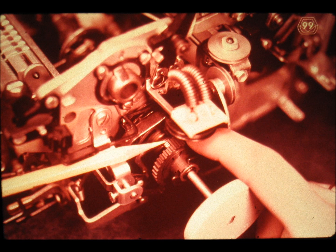Cassette 3, program 10-1A, slide number 99. In order to make the adjustment of the shift cam overthrow stop, before you attempt to make the adjustment, you will have to remove the shift clutch ratchet and the hand cycle wheel. Otherwise you will almost certainly damage the screw head or the ratchet, for lack of the proper angle to apply the screwdriver.